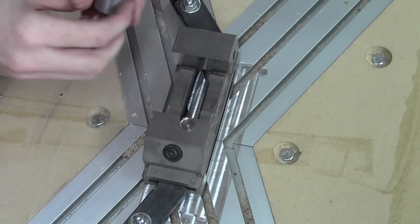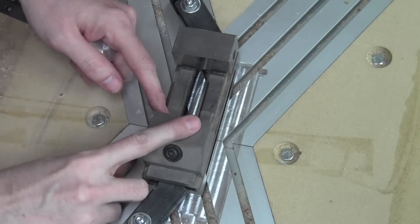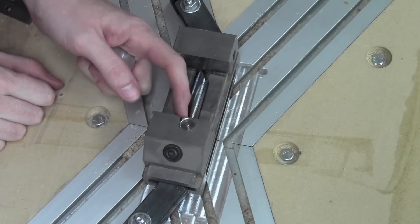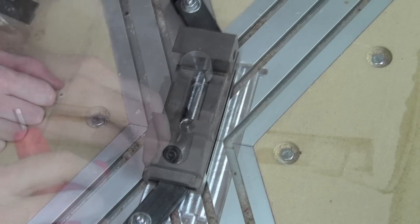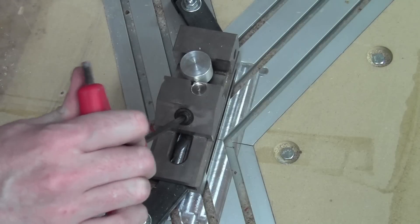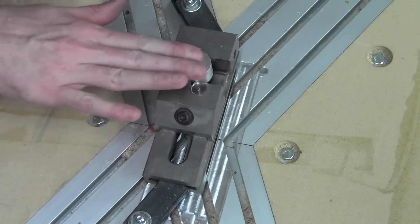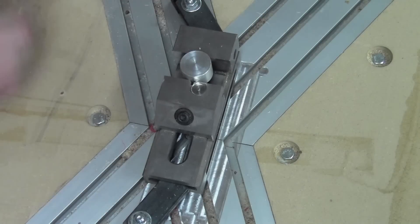We are going to take our part. There is a V notch in the jaw — that is where you crash an end mill into the machine. There is a V slot right here so it will register this round bit here. Basically what we have done is made sure that it is pretty vertical and it is held really well. Now we are ready to get the CNC up and do a centering and flattening phase.